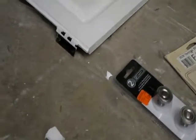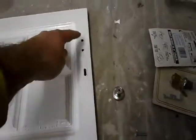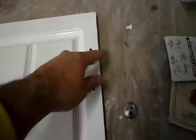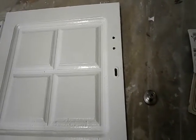If you want to add shelves at the bottom, feel free — I'm not going to, because the items I'm putting in this curio are going to be a little taller. Next, I have handles for the bottom two doors. We currently have two holes from the old handles, but I'm using a new style handle that only requires one hole. I'll use the bottom hole and fill the other with white silicone caulk since we painted the doors white anyway. I'm going to leave the lock opening as-is — nobody would know from looking at the cabinet.